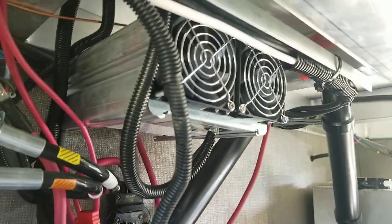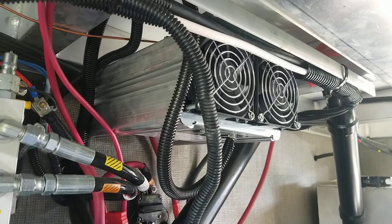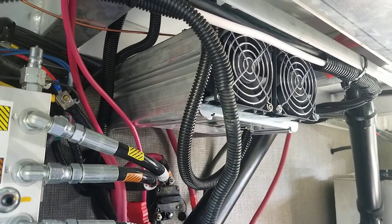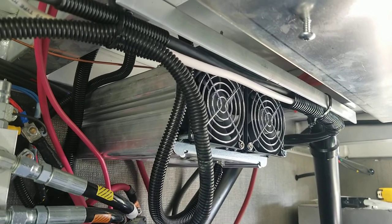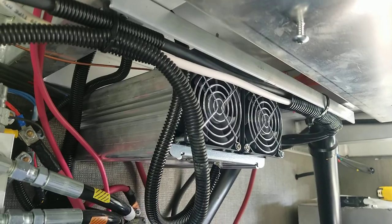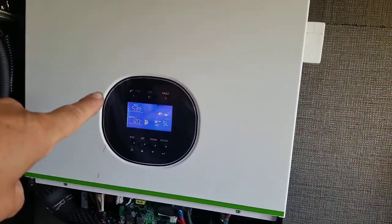And that will power the refrigerator for about, assuming the inside temperature is about 77 degrees, the refrigerator will pull 1 kilowatt hour a day, and 12-volt batteries at 100 amp hours is about 2.5 kilowatt hours of power. So you'd get about 2.5 days, or roughly 60 hours of battery life, which is pretty good after the primary system fails, because after 60 hours, the sun is likely going to go ahead and automatically kick this system on again.